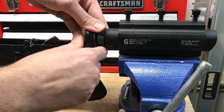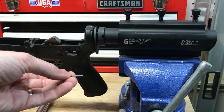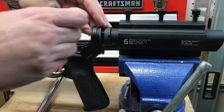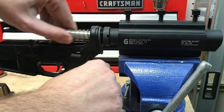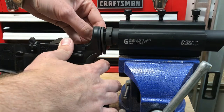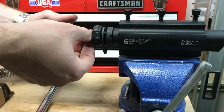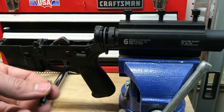On the other side of your takedown pin you've got a spring and detent in there, so just be careful not to let that come flying out unexpectedly. We'll back off the castle nut, give it a rotation, capture the spring with my fingertips, and get it out while we finish this work so we don't have to worry about dropping that part. We'll also depress the buffer retainer pin, get the buffer and spring assembly out, and back off to remove the buffer retaining pin.